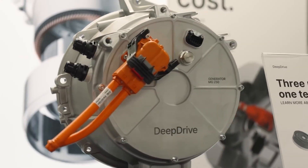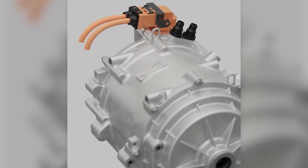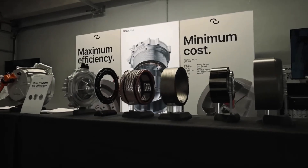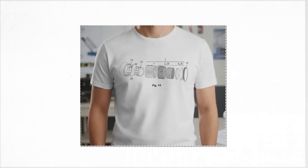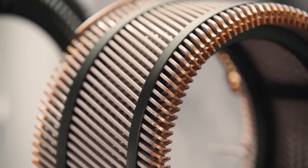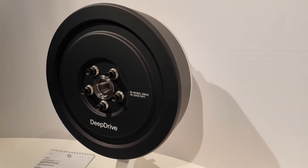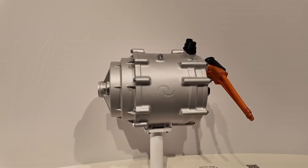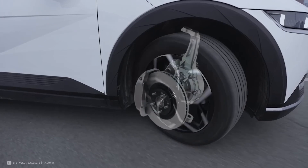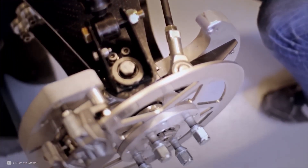I want to focus in on what Alex said here, because he mentioned structural stability and heat flow, which we know are both very important considering there's now no yoke. The torsion-resistant windings are crucial. With magnets on each side from the rotors pulling in different directions, the magnetic forces want to twist the windings in complex ways. Without a yoke to hold everything together and rigid, these windings have to be extremely strong to keep their shape and work reliably. Instead of using wires for the copper windings, they use conductor bars. These bars create a kind of truss system that supports itself against the magnetic fields that are trying to warp them. One end of the copper bars is also attached to the motor's housing, which helps structural rigidity and is crucial for heat rejection, as heat flows through these thick copper bars into the housing which contains the coolant fluid. This means that the rigid copper windings solve both the heat rejection problem and the structural rigidity problem that came about from removing the yoke.